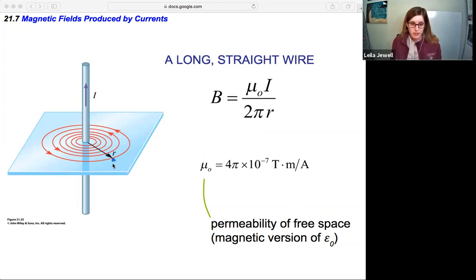What's the direction of the magnetic field at a given point? Because we've used Right Hand Rule number two, we know the magnetic field creates circles around the wire. Notice the field lines are closer together near the wire because the magnetic field is stronger there, and they spread out as the field gets weaker moving away. At a specific point, follow the circle and draw the tangent — that's the magnetic field at that particular point.